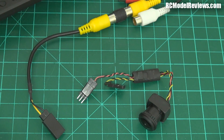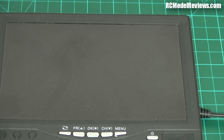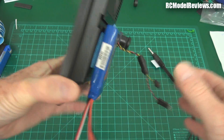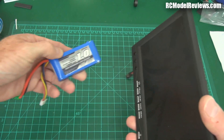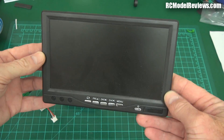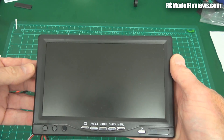I've got a separate LiFe battery at about 6.6 volts to power the Owl camera, and I'm going to velcro it on the back of my little LCD — making a night vision setup. I'll go wandering around the park at night to see what it looks like in a relatively low light environment. There won't be a microphone on there so I'll have to overdub the footage. I also want to get some daylight footage to compare, since it's not useful if daytime image quality has been sacrificed for nighttime performance.